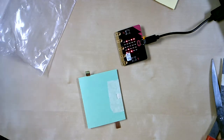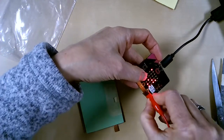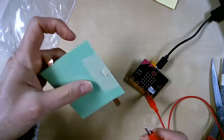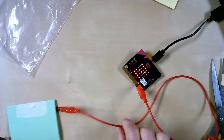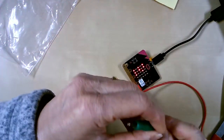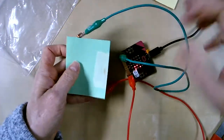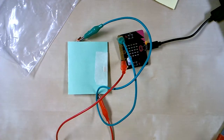Now I just have to attach the wires — you can pick any wires you want. I use red for power, so I'm going to plug that into the 3-volt pin. You can plug it this way or that way, whichever you like best — just make sure it's secure. I attached one side and the other side to the 3-volt. Now I'm going to get one more wire — I'll use green, and my code has pin zero. If you used a different pin in your code, make sure the wire matches that pin. I'll take the other end of the alligator clip and attach it there. Now I have both wired, and I'm making sure the alligator clips don't touch — you can put a little tape down if needed.